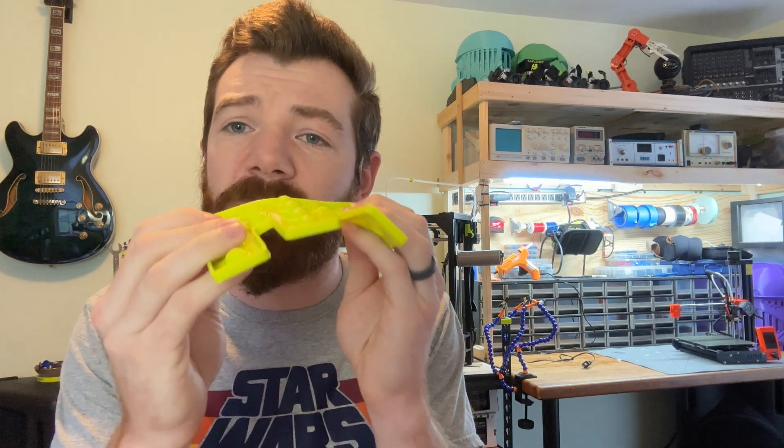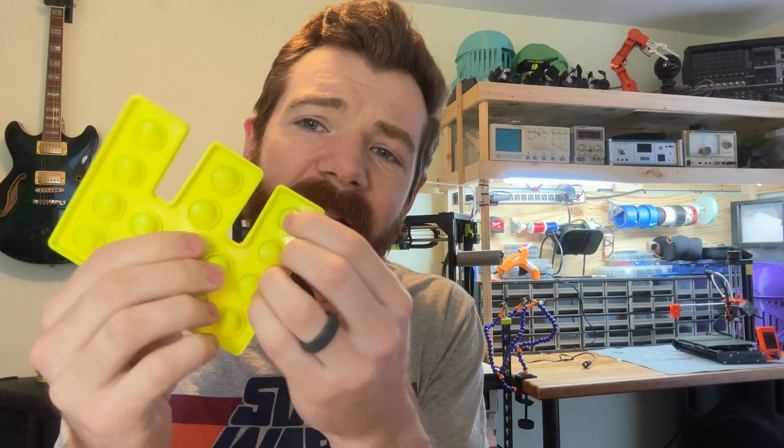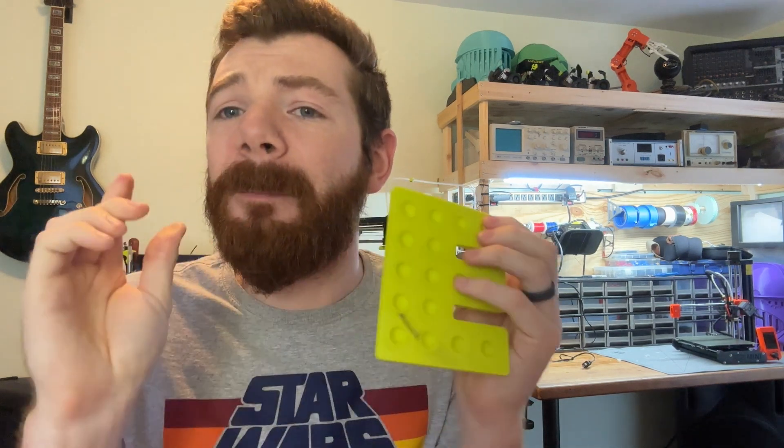For this project, I'm working with my LulzBot FDM 3D printer, where I'm going to be extruding a TPU flexible rubber filament. In order to be successful, we need to design our models to not only have the Pop-It ability in terms of engineering — so that it has the shape that literally mechanically pops — but also so it can be produced on our printers.